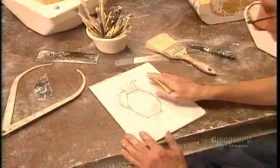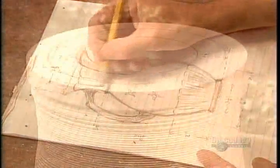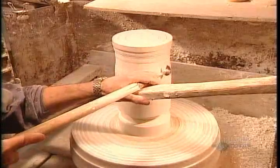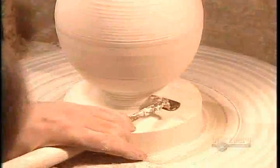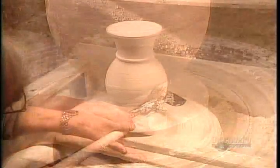This earthenware piece starts with a technical drawing based on an artist's conception. Following the specs, they use a series of specialized tools to sculpt a plaster model on an electric potter's wheel. They check the diameter with calipers. The model is 7% larger than the finished piece will be, to compensate for shrinkage that will occur during drying and firing.